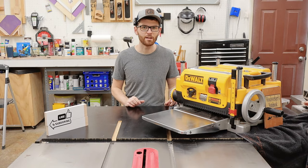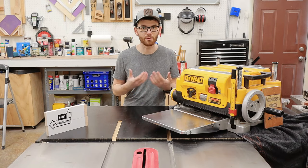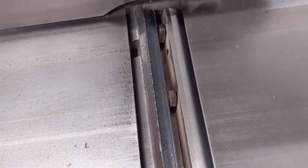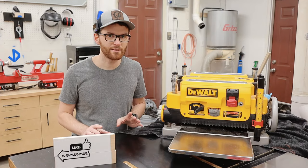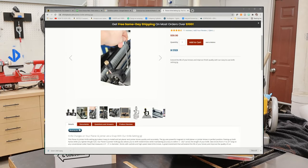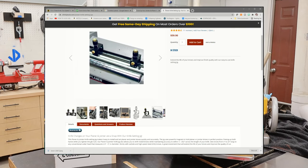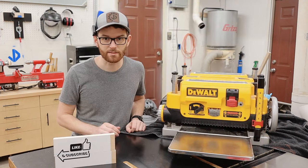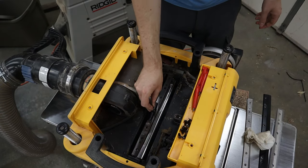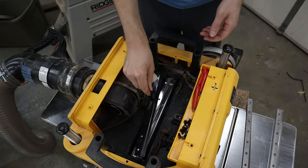The next feature I really like about the DeWalt DW735 is the way that they engineered the cutter head to use these easily replaceable knives. Most planers or joiners use a clamping mechanism to hold the knives in the cutter head that don't positively locate that knife. What this means is that in order to replace the knives, you would need to use a special jig or a dial indicator to make sure that all three knives were correctly positioned at the right place. If even one of the knives is sticking a little bit too far out or not far enough, this is going to result in a wavy, bumpy surface on your workpiece. The smart engineers over at DeWalt solved this problem by designing the cutter head with locating dowels. In order to swap in new knives, you simply use the included tools, which are built into the design here, remove the old knives and drop in the new knives.